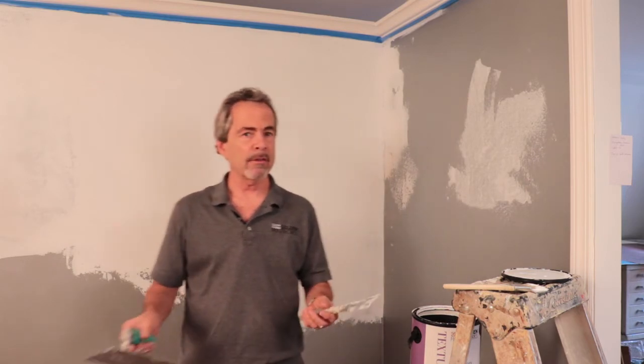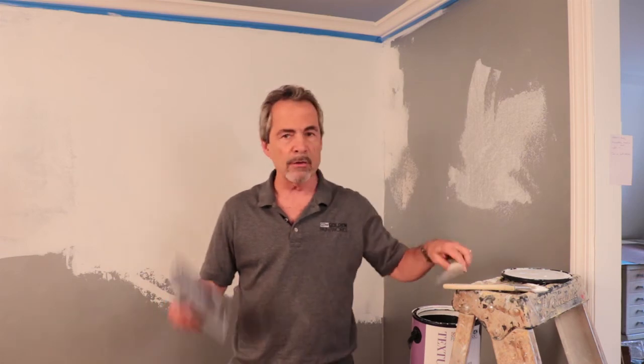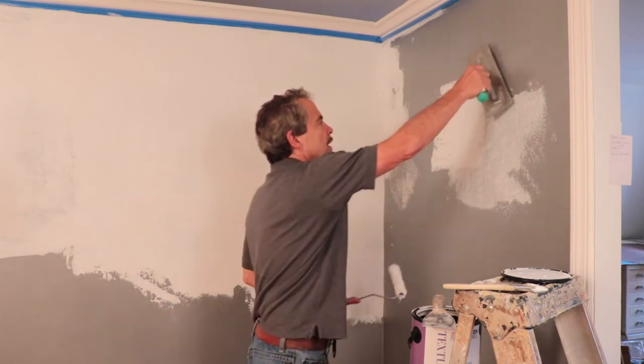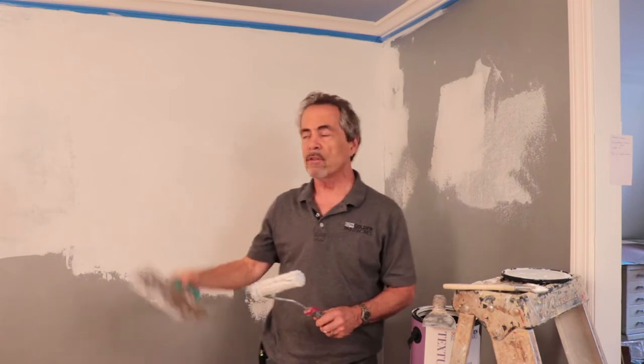You can use a trowel to apply any kind of texture: joint compound, hot mud, marmorinos, Venetian plaster — it all works. But if your plaster or texture is very thick, I'd always recommend thinning it down with water to make it easy to work. Sometimes your plaster may come in very thin. For example, if you take an already thin plaster and add four or five ounces of black pigment, that'll make it like soup. If it's too loose to use with a spatula and a trowel, you can take a roller — like a half-inch nap roller — dip it in, put that on, and then blade it down. It puts it on very thin and may take two or three coats to achieve the same thickness as one coat, but it's another way to do it.